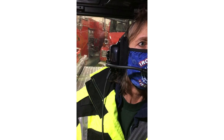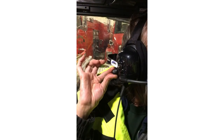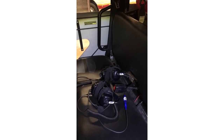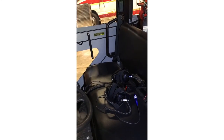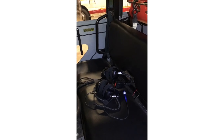You can perform your own sound check: test one, two, three until you find a comfortable volume, and that will be the volume at which you hear everybody else. The COM system is capable of adapting to portable radios, with a push-to-talk button available for the primary attendant or the right front seat. A word of caution: if the patient communicates something at the point you push the push-to-talk button, it will be transmitted — so take that into consideration.